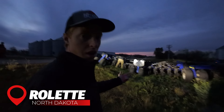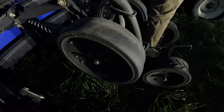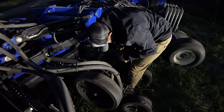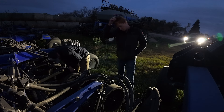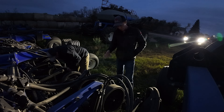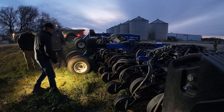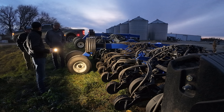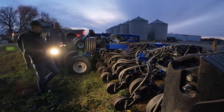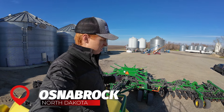Out here early at a New Holland drill — this is a double-shoot setup. This is that $450 gauge wheel right here. For the closing arms and pivots — improved closing arms and all the main pivots — we'll do the rebuild services of the disc hubs. We have really good disc options. The owner has had the machine four years. He's gone through two sets of discs from us — he did round ones first and then went to the notch.